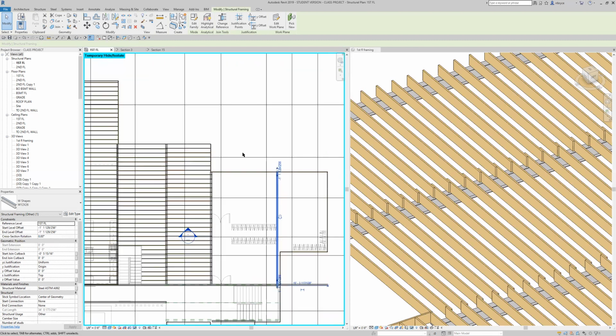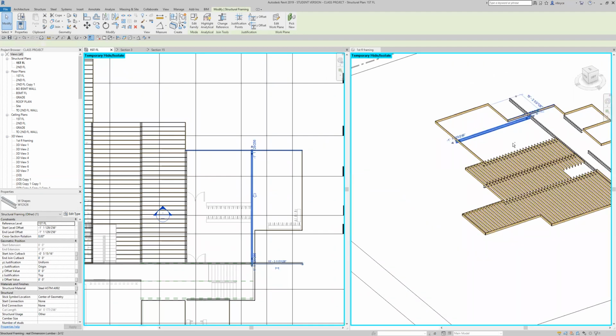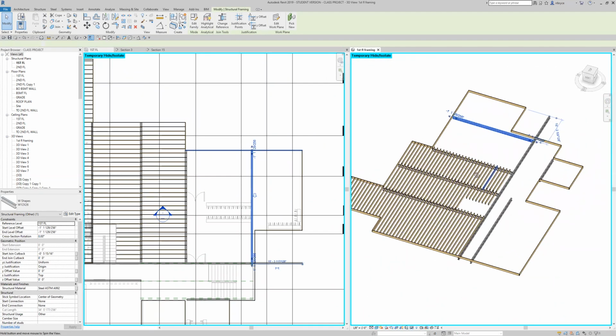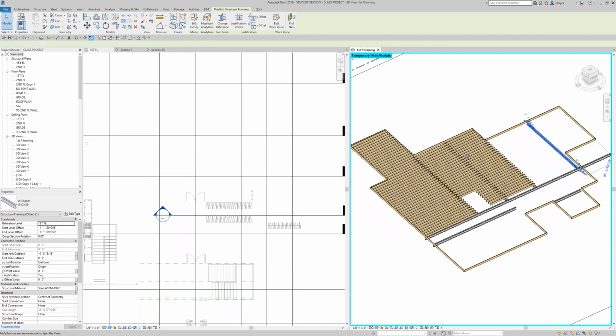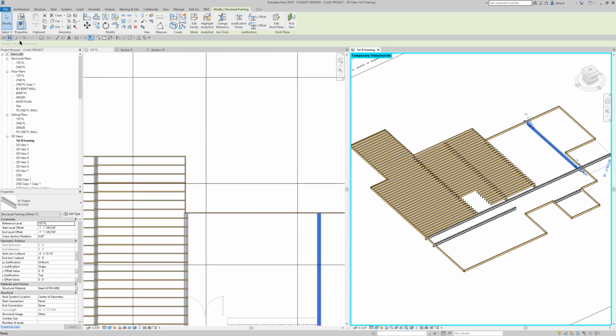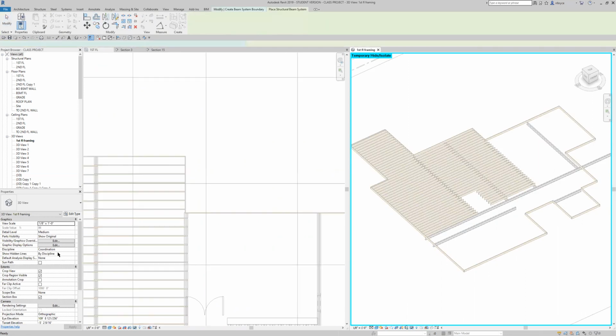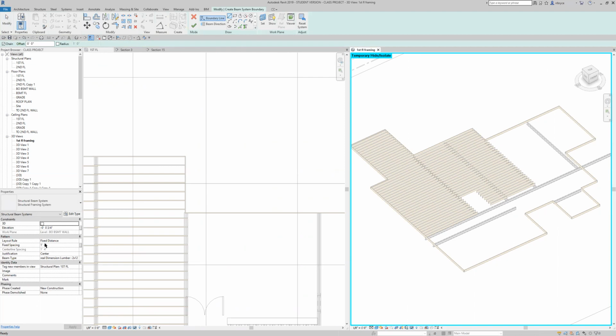All right, so it's time to put in the next framing system, which is right here. Let me spin this around so it's a little bit better oriented. Okay, you can see the steel beam. Steel beam is right here. I'm going to save it again just as practice here, and then we'll go structure, beam system. Let's check the constraints. It should default to what I had before. 1'4", which is 16 inches, 2x12, real dimensional number 2x12.